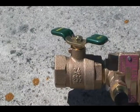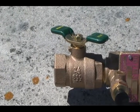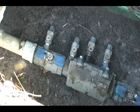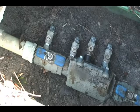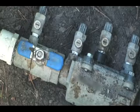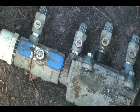A backflow preventer stops contaminated water in the tank from backflowing to the water source, whether that water source is a well, a public water supply, or surface water. That's especially important if your water supply is feeding your watering facilities and your home. Backflow preventers are usually required by law when your water source is a public water supply, and NRCS does require one to be installed if your water source is a well.